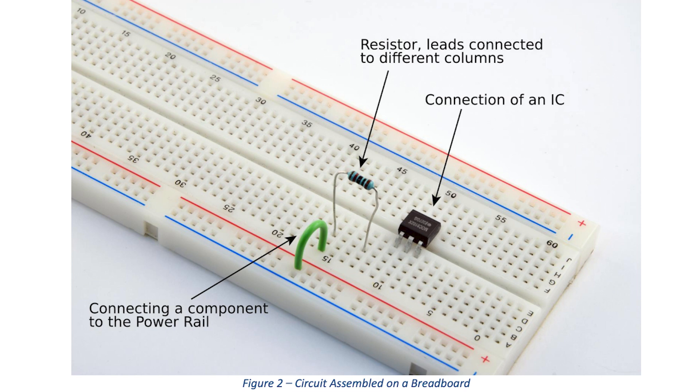Such multi-pinned components must always be planted into the breadboard in this way. The pins of the IC are placed in separate columns and are not electrically interconnected. If several pins were in the same column, you would short circuit their terminals, so you probably wouldn't be able to connect it to the power supply properly, or the IC would suffer permanent damage. You should also pay attention to the placement of two-pinned parts: since connecting these terminals is pointless, they should be pressed into two separate columns. When you aim to establish an electrical contact, the wires or legs to be connected must be placed in the same column.